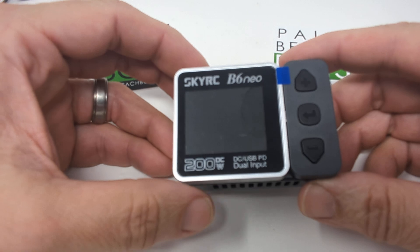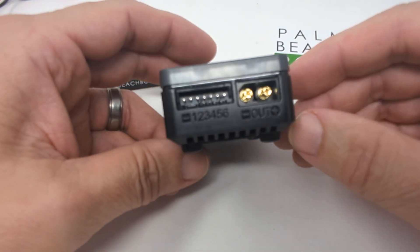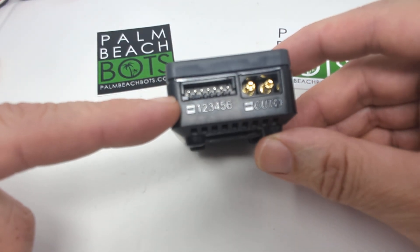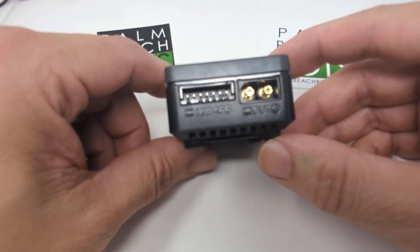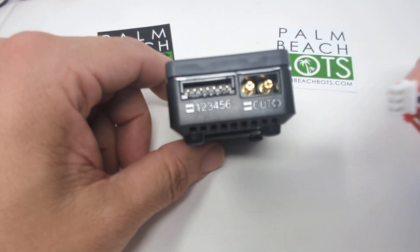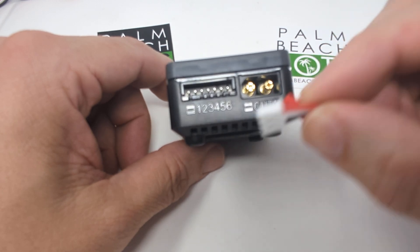The screen is right here. On this side you have your output — that's the XT60 connector, that's where you'll plug in your adapter — and the balance port is on the left. If you can see the numbers 1 through 6, it will balance up to a 6-cell battery. In the case of this video, we're using a 2-cell, so that's why it has three wires: one for each cell, and then the ground wire on the far left.